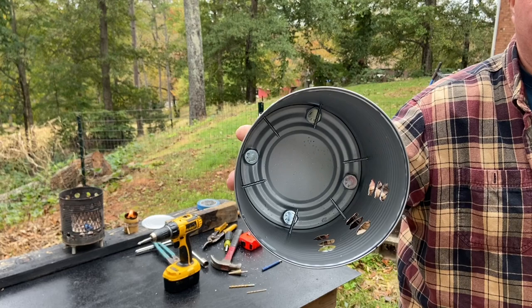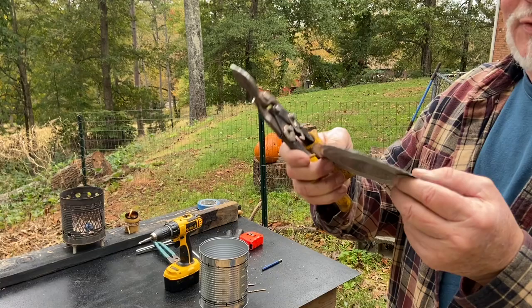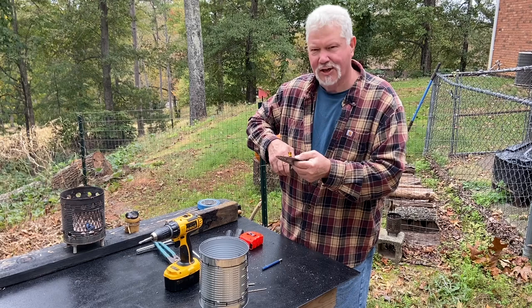Let's go ahead and keep working on the elevated floor. I'm going to cut an 1/8 inch off of here, so of course it's going to be a total of 1/4 inch. So if this elevated floor is all the way over to one side, you'll see a 1/4 inch hole right here. If you don't like that much space, you can cut it to a closer tolerance than that. This is just a little bit wider than a 1/16.